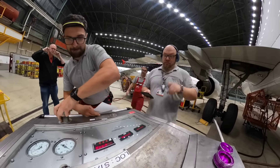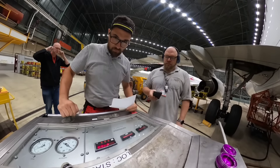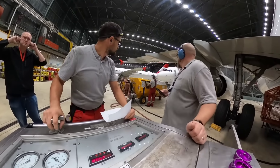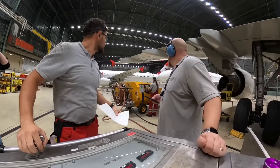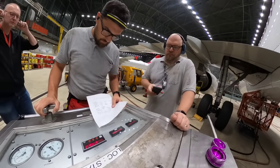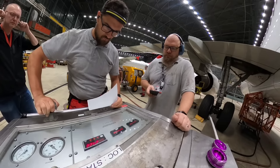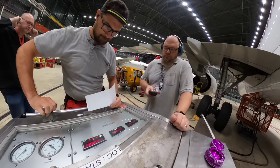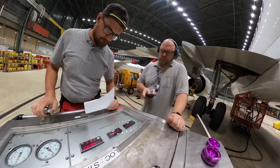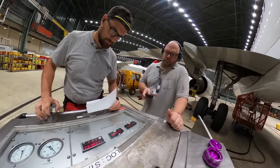All values are okay so I'll set the flow control back to zero. For the next step, my colleague needs to reduce the pressure on the hydraulic cart to simulate a lower aircraft speed. When we have stable pressure on the hydraulic cart, I'll adjust the flow to 60 liters per minute. In this condition the RAT pump will operate in anti-stall condition — the anti-stall valve inside the RAM Air Turbine will reduce outgoing flow, which removes the load from the hydraulic pump and allows the RAT to hold RPM.